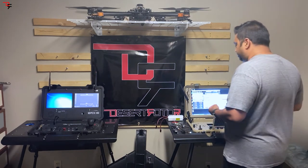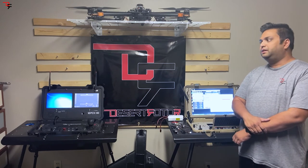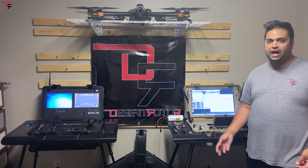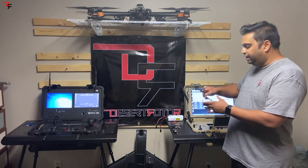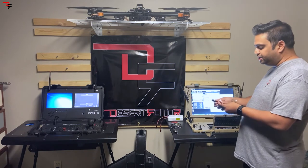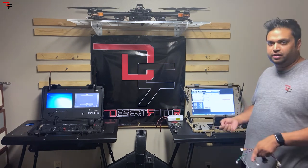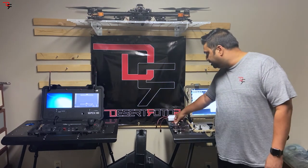As far as radios go, we offer a limited selection on our website but it is absolutely not limited to what you see there. We have many clients all through the world using their own preferred radio systems with our GCS platforms. We can natively stream PPM, SBUS, and serial protocols, and it's fairly easy to install any sort of radio with our system, mainly because we designed very simple cables that will interface with your radio. Some clients cut one end and terminate it to whatever radio they're using. All RC-type radios are compatible.